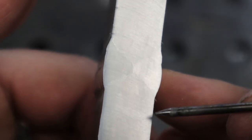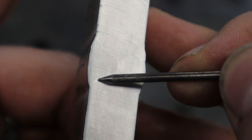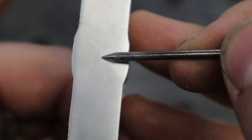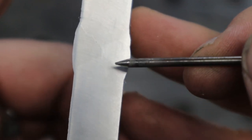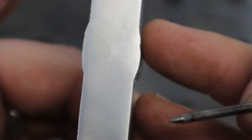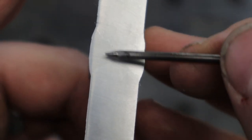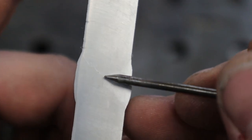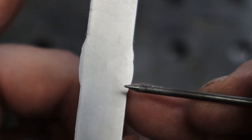I got this thing polished up and did a light etch on it. On one side we have our 4043 root and you can see the perimeter of it, then our 5356 filler which forms a little arc where we ground out with the die grinder. We had full penetration — no air pockets in there. Interestingly, the 5356 has a similar color to the base metal while the 4043 contrasts a little more with the etch. Either way, no cracking and no air pockets — a nice clean full-penetration weld.